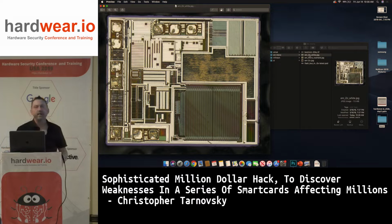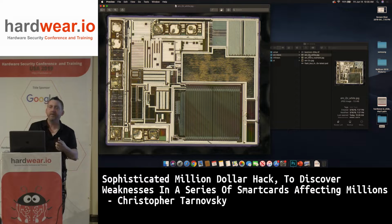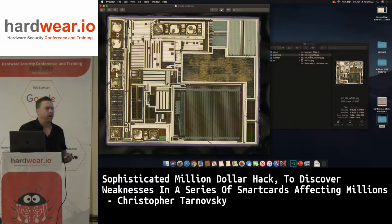Then you have to study the boot ROM and look for an address to strap to jump into flash, because you don't want the boot ROM to power up. If the boot ROM runs, as Chris said yesterday, all of these chips are doing self checks on power up. They're setting trimming values for VPP, the programming voltage for the EEPROM and the flash, stuff like this. They're setting up their PLL to run.